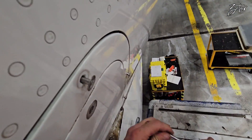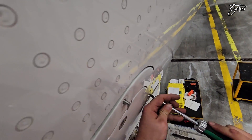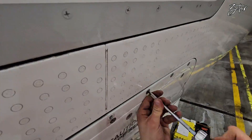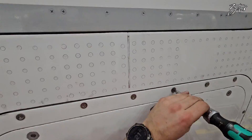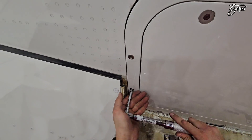We perform a resistance check and the final protection of the bonding point. Finally, we can proceed with the installation of the slide into the frame of the aircraft. One last piece of advice: before you install the slide, double-check all receptacles, because if you find that one is damaged at this point you need to repeat the whole process again. And again, all studs need to be torqued to the exact value.